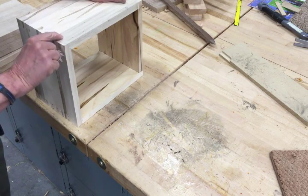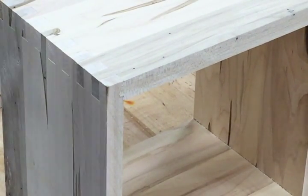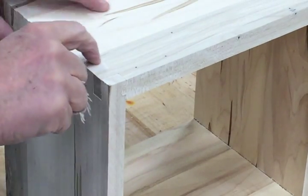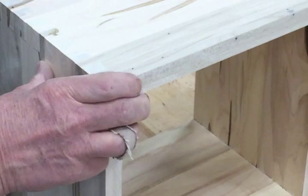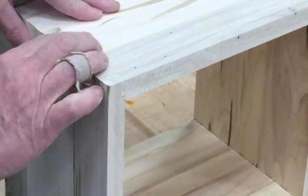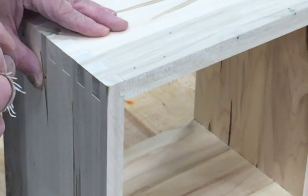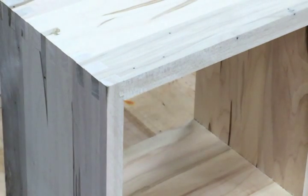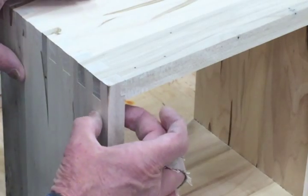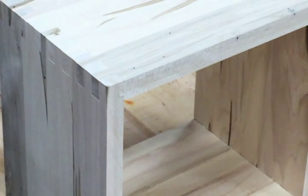These points where the pieces come together — they're tight, they're almost flush. This is pretty much what you're after. That's just a nice clean one; it's not going to take a lot of sanding or trimming. A lot of this is because the dado head was where it belongs. My pieces are three-quarter inches thick, and that combination always works. It's when you mess it up — you don't check the settings to make sure they're three-quarters, or the dado head blade isn't the right height — that you cut yourself in for a lot of work.